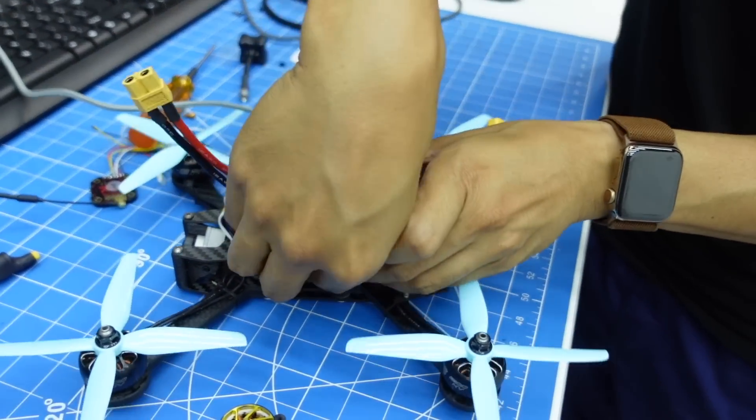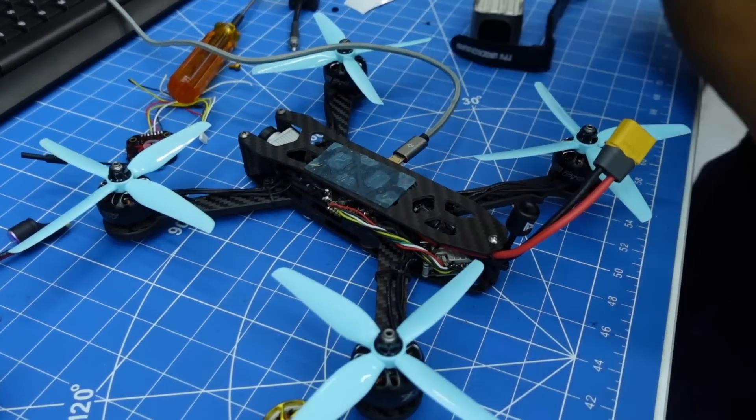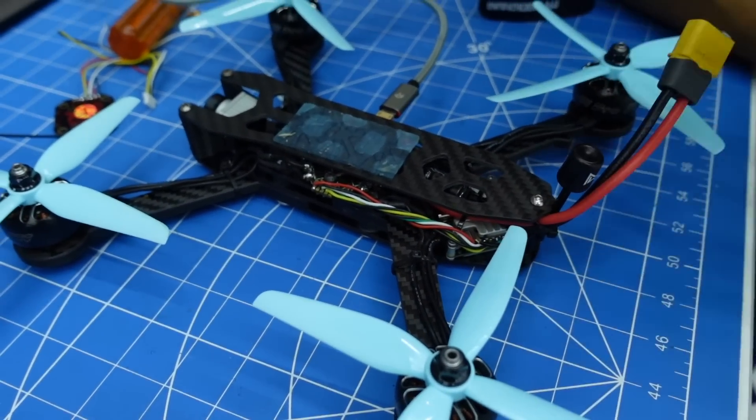The general thing you want here is: can Betaflight's RPM filtering and filter tuning get rid of the noise? The answer is yes. I could probably start turning off some filters to really extract more performance, but I'd say this is a good baseline. We are probably good to continue on in terms of figuring out what else we need to do to make this work.